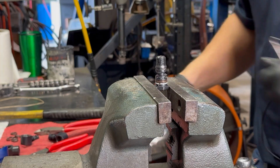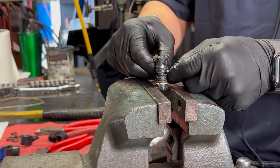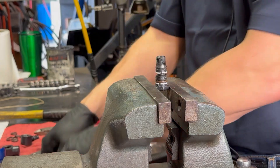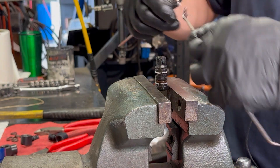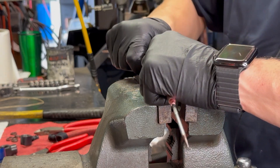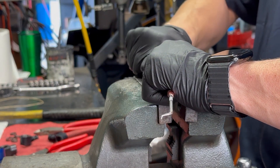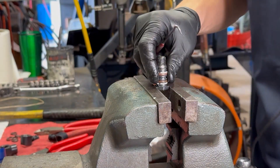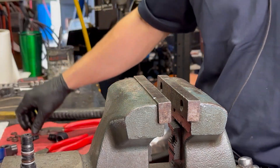We're going to get the backup in first — not sure if that's the best way to do it, but that's the way that I do it. Got your seals ready on your picks. Drop on the ground, pick up another one, and we're going to start again. Using my thumbs a little on this swivel so that I don't push the stem all the way around the shop. All right, this one's good. It is ready. I'm going to put it to the side.